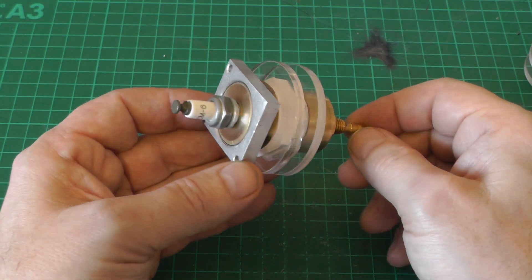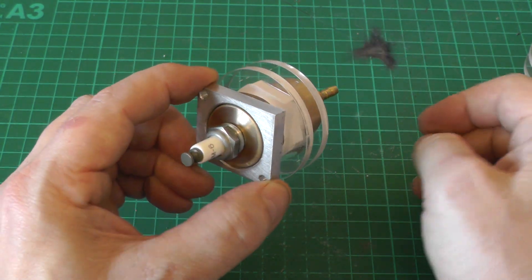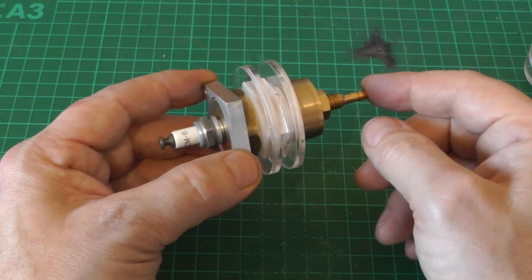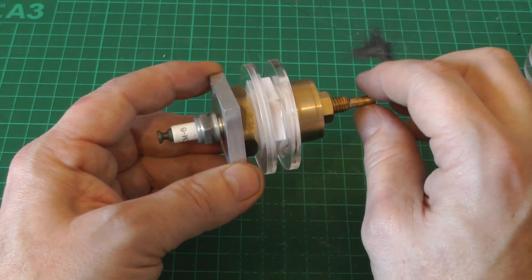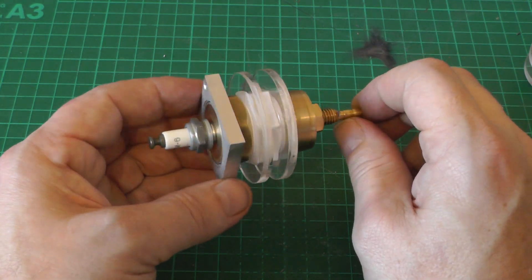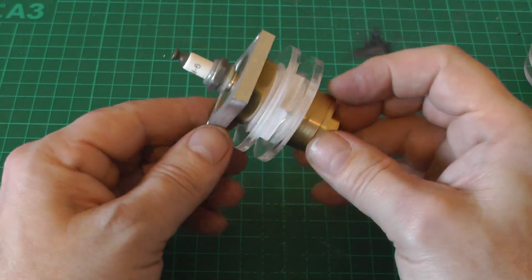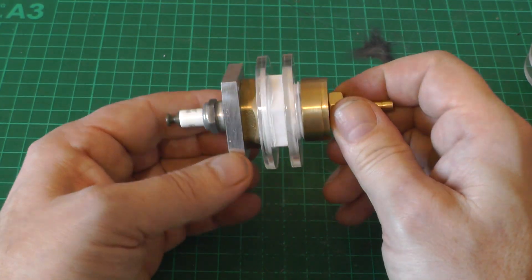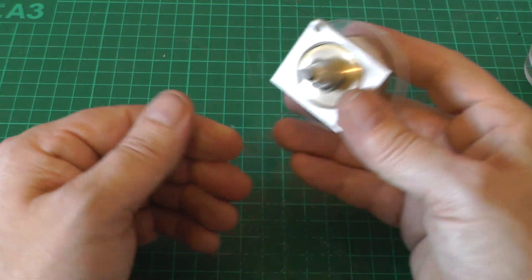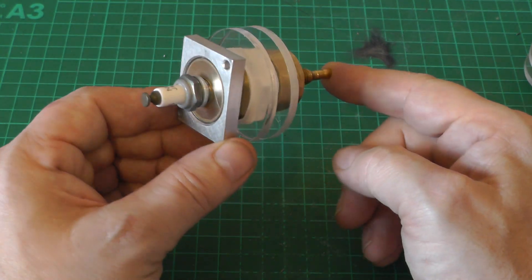All in all this triggered gap has worked out very well in the nitrogen laser, and I'm fairly convinced it could be pressed into service in other things as well. In a Marx generator we'd only need to trigger the bottom gap and then all the other gaps would fire off automatically because they've been over-volted. And if someone were interested in putting this in a Tesla coil to have a single-shot Tesla coil, that would be kind of cool too.